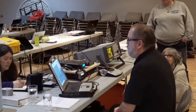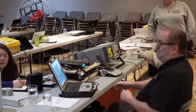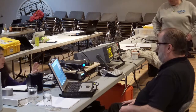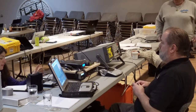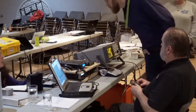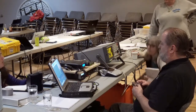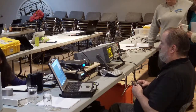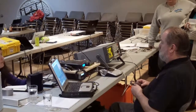That is 52. What radio is that? That's an 857. It's a Yaesu, an all bander. So when we set up our TNCs, for the command XMIT level, we put in the number 52. It's interesting because this is 52. My Kenwood V71A is 35. But you'll take a look at a lot of these Motorolas, and they're like 283 and things like this. Very, very different numbers.